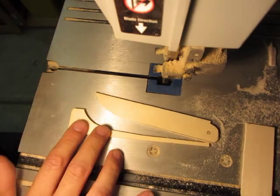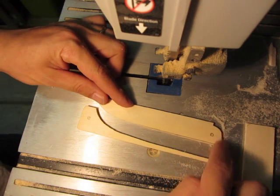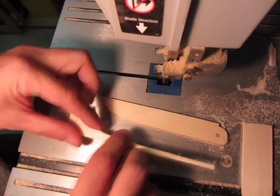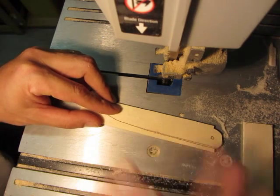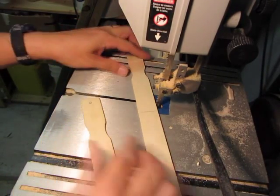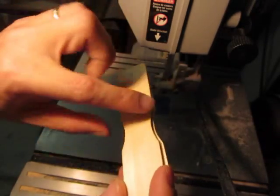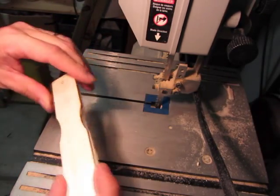Here are the two parts for the knife. I didn't cut exactly along the lines because I freehanded the spring back portion a little thinner — you just have to experiment with what works for you. I also forgot to mention the finger groove for the other side, so I laid out another line on the outside cover. I'll line the two pieces up and freehand a nice deep finger groove to grab the blade when the knife is assembled.